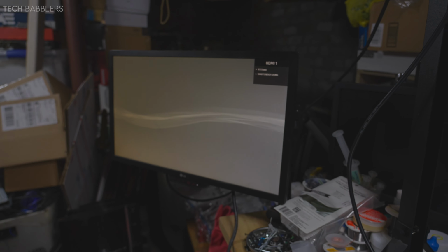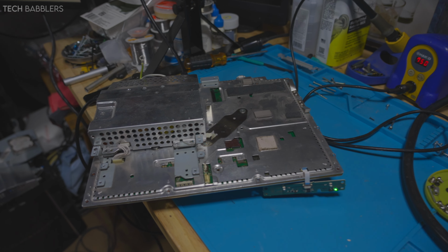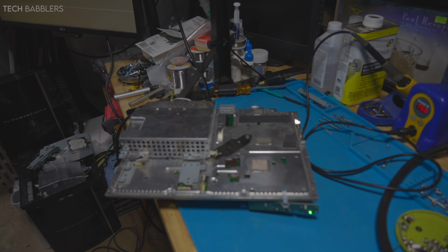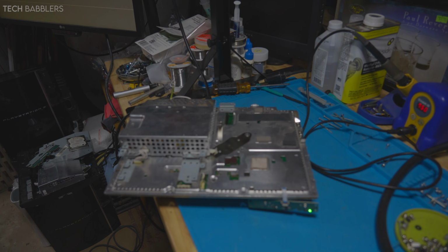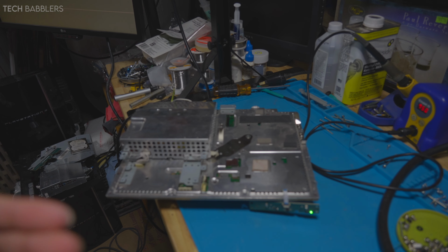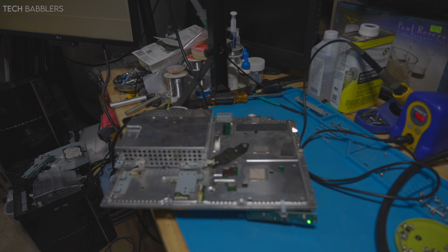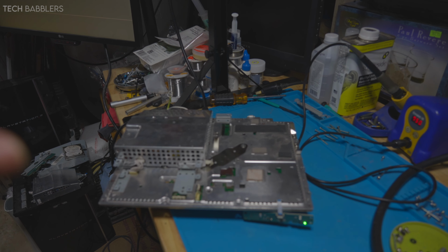Back on it. So I don't really know what to blame this on. It could have been my profile. To be honest, I feel like maybe my automatic profile didn't do a good job with the reball when I did it, and kind of redoing it with this more manual one, the temps got closer to where I needed it to be, and it was more controlled, so things went off even better.